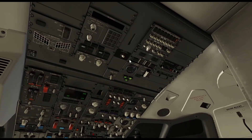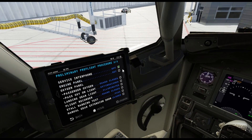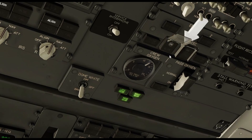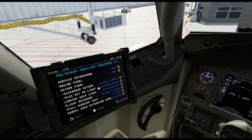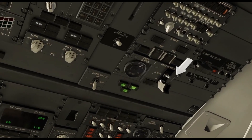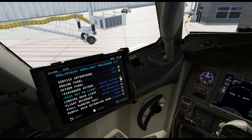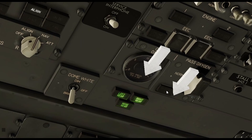The interphone — we just want to make sure that it's off, which is right there. The next one is the engine panel; they're usually set or ready. You just want to make sure that they're on — there are flip switches here, you can do alternate or on. Usually when you're starting the flight it's already on; you just want to verify. Passenger oxygen — you want to make sure the guard is covered. It's right here: you've got normal and then on. It's already set in the normal position. The passenger oxygen light — you want to make sure that it is extinguished, that it's not on.